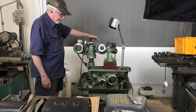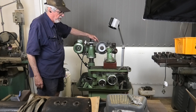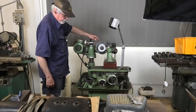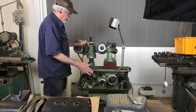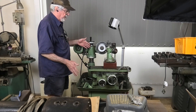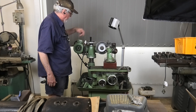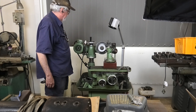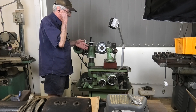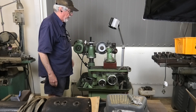On the table, this machine is very adjustable. You've got a sub table and the upper table. The sub table can move in and out about 200mm, which gives it a great variation in scope. It's also got a short leg and a long leg on the grinding wheel head. So if you spin that 180 degrees, it changes the position of the wheel - you can bring the table up onto a different wheel, which would save you changing wheels for all your different operations.